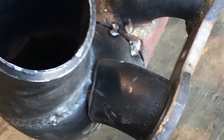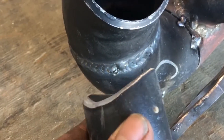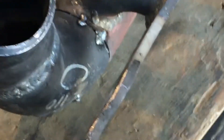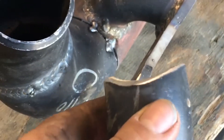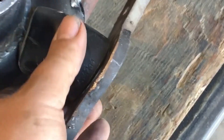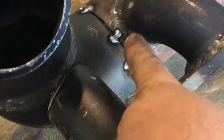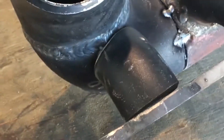I just coped out another one of these one-and-a-half inch schedule 40 pipe weld elbows, coped it out in the vice with a flapper wheel. That will go in right there for that last runner. Now I've got to cut a hole out right there, so I'm going to break these tack welds apart first, mark out the hole, then hole saw a hole for that last runner.